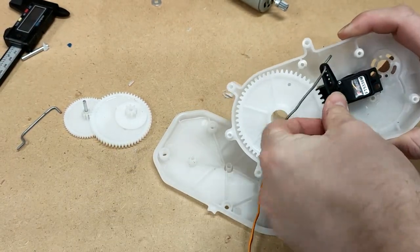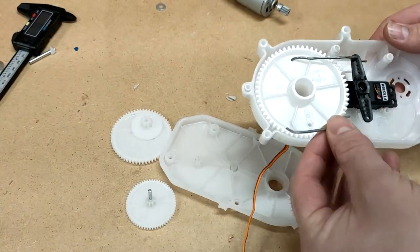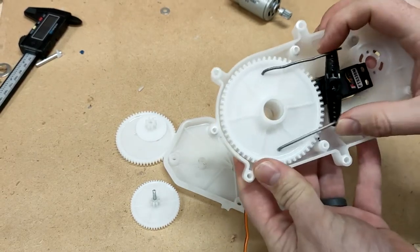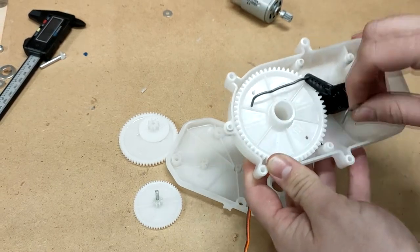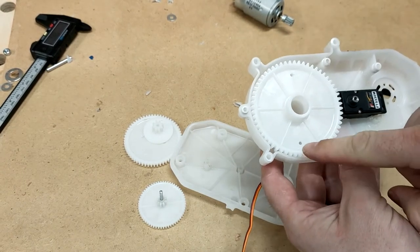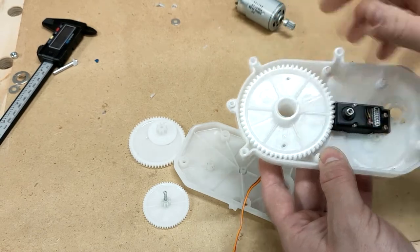This is my mock-up piece. We have a servo horn which will then attach to holes in the gears, top and bottom. And then if I align them properly, that allows us with the servo to turn the main gear. Obviously this isn't very refined, but we only need about 120 degrees of rotation. The gear moves from this point here to a point here and a point there — that's the rotation, and we can easily do that with that servo.